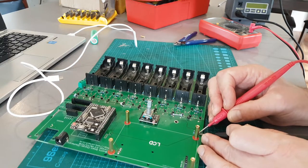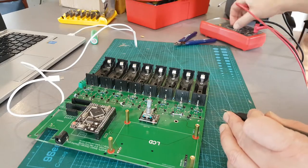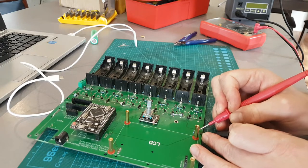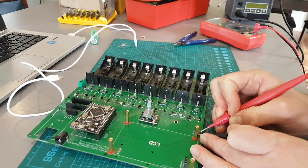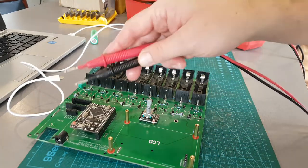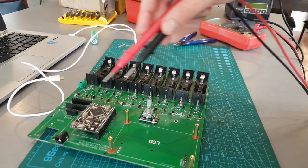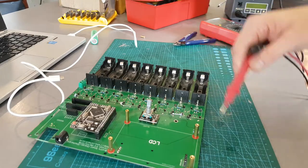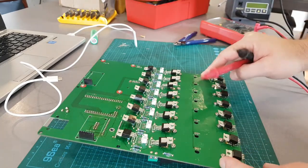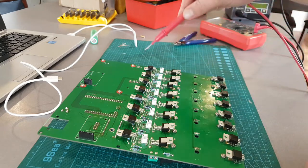Say I've soldered this in - hold, check between these two pins here on diode mode, check all three pins are not touching each other. Then load the sketch, run the find-sensors routine, and it should say 'found one device' - and you're like, yep, that's good. Then go solder the next one. Start somewhere easy, go out the back, put that one in, check for shorts every single time. Every time you solder one in, check for shorts - solder one, check short, solder one, check short.